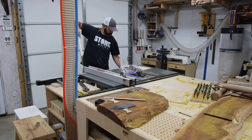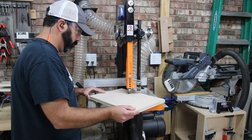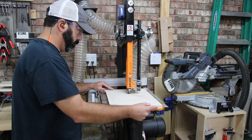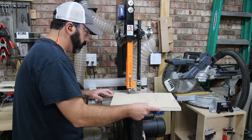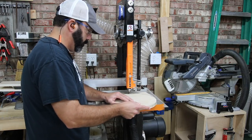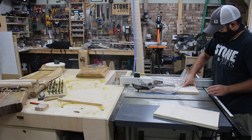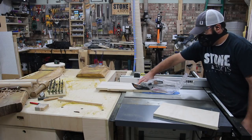So as I said, it's three pieces of wood — the top is round and then you have two rectangular pieces of wood which need to have certain pieces cut out. The round top I'm cutting out here on the bandsaw; this can also be done with a circular saw and a jigsaw. In this video I'm using a table saw and a bandsaw — either is fine. Now I've cut out the round top and I'm going to cut out the other two pieces.